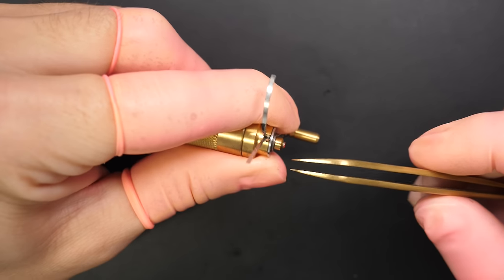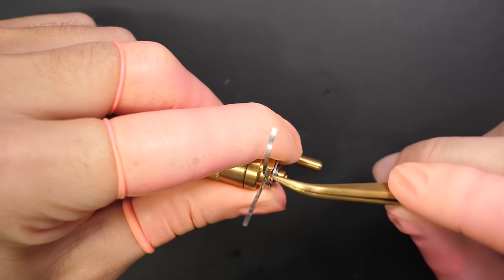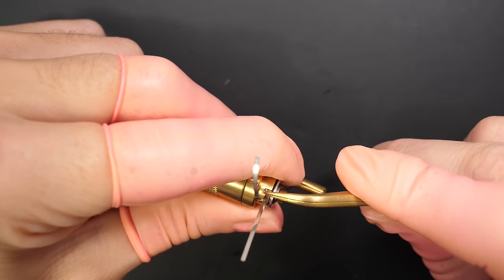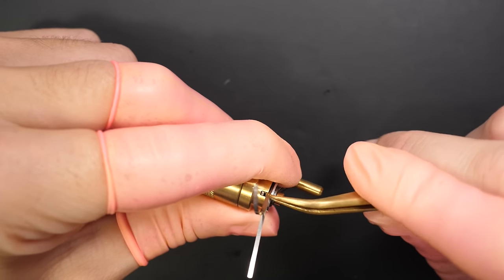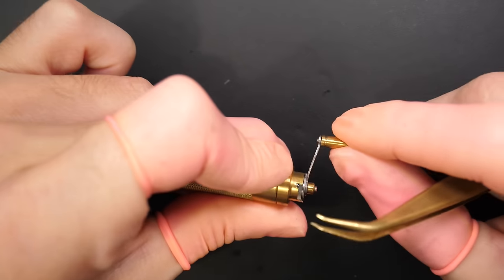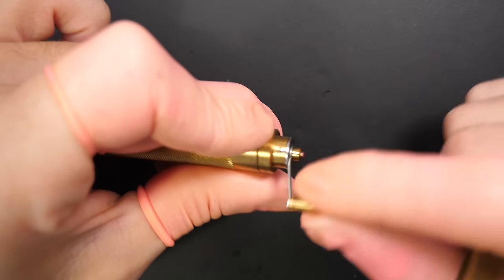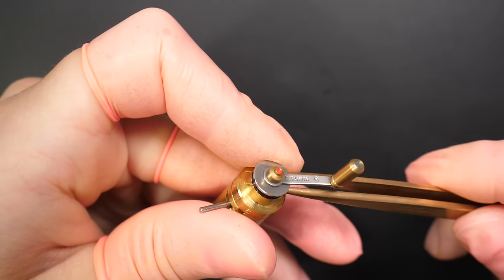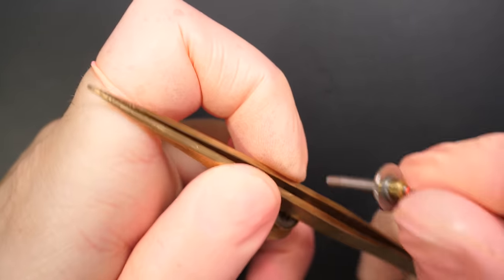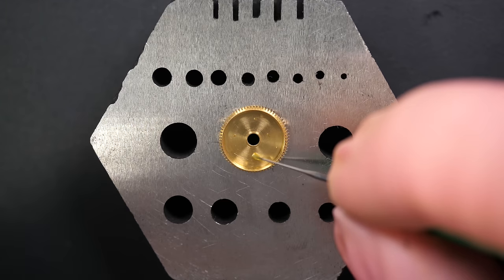I just need a little help to get it inside the winder — there we go. Push it underneath; there's a little tongue underneath. There we go, that's in, and I can finish winding it. Now just unwind it slightly to let it relax, and I should be able to remove the handle. Gently removing the handle — perfect. The spring is wound.